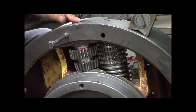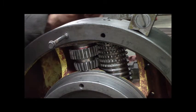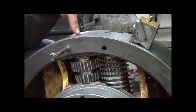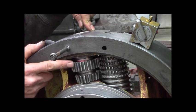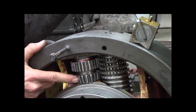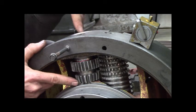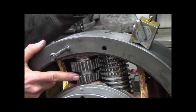Look at that - I can spin everything. If you're going to put an Allen wrench in the top here, it's going to turn this shaft. We never had the ability to adjust that there - there was no hex there. I added that hex primarily to be able to adjust the offset of the boring head manually, because we're no longer going to have it on a Summit mill. There's no way to adjust it until I put that hex in there.